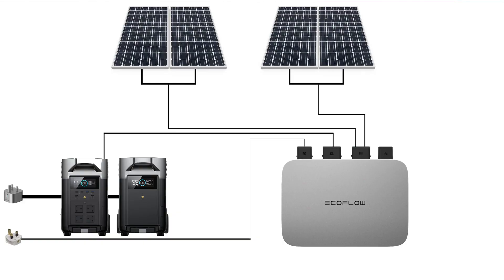Now let's have a look at how the system would work. It comprises of three parts. Starting with the panels — I'm going to use four 200W panels arranged into two strings with the panels wired in parallel to each other. I'm not going to go into the difference between parallel and series organisation, but the reason I've done this is to keep the voltage down below 70 volts, which is important for the next step.